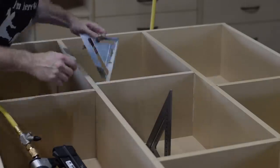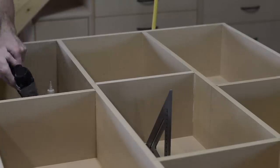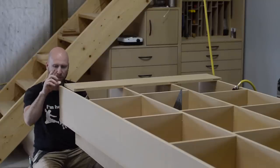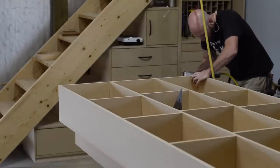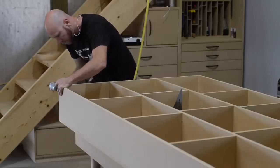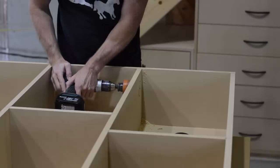Even if you're a more traditional woodworker using a traditional cabinetmaker's bench, I think a torsion box could be useful in your shop as a glue-up, assembly, or finishing bench. I would suggest making it light enough and portable enough so you can take it down and put it against a wall when you're done. At this point the grid work is all glued and nailed together — it's easily moved but not yet glued down to the bottom piece.